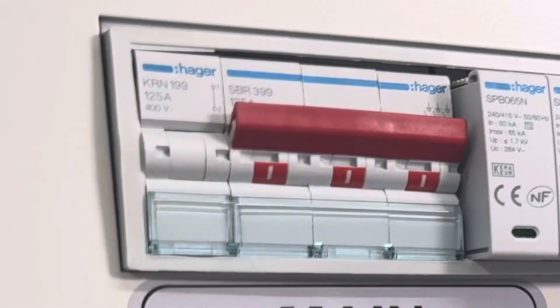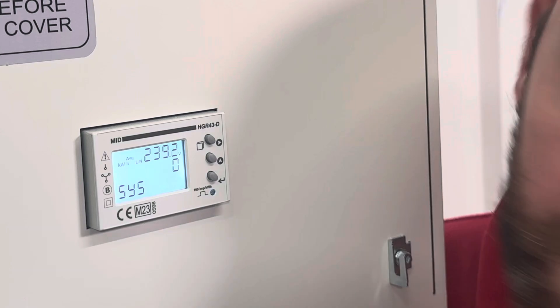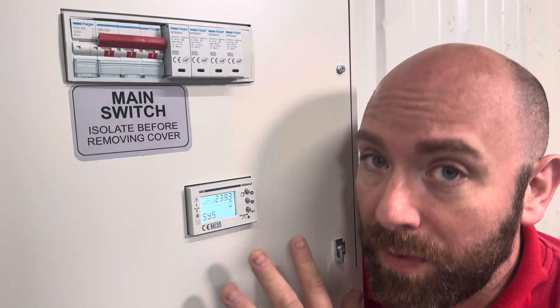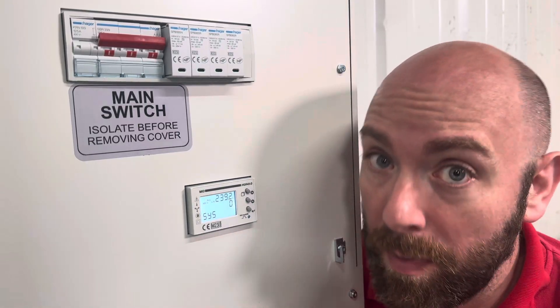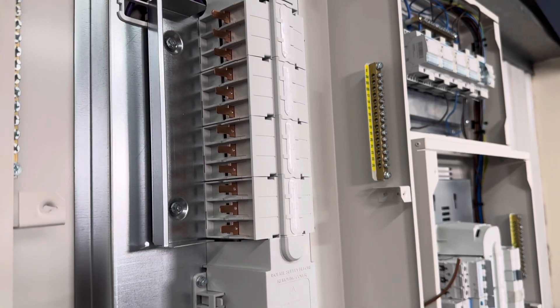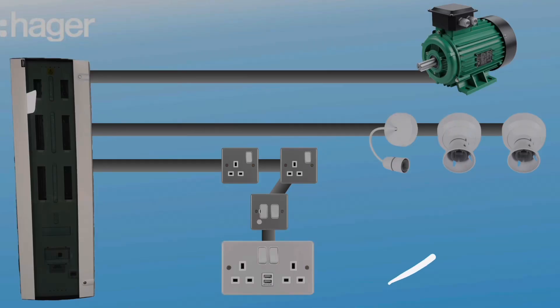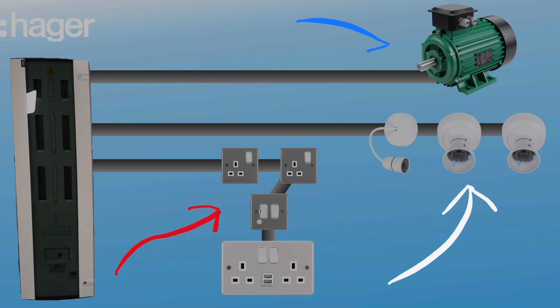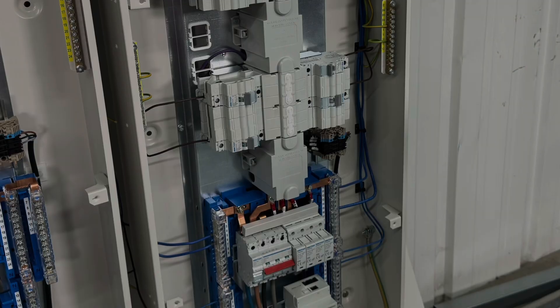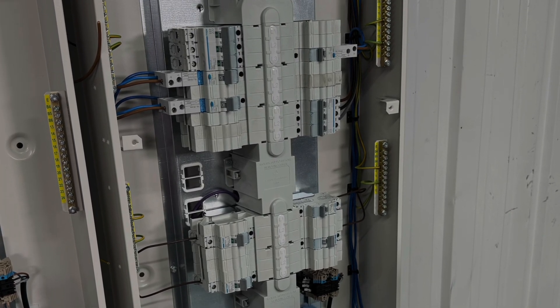So let's get this fired up. Straight off the bat it gives me the line and neutral voltage — we're at 239 volts. One thing we have to do for this particular unit is set up the modes, and there are four modes to choose from. The reason being is that this will distinguish between each pan and what that pan is actually supplying. So if the lower pan is supplying lighting, the middle pan is supplying power, and the upper pan is supplying other services, then this will know and report that data back to the user. On the 125 amp unit, where we only have two pans, we can set the modes up on that as well.